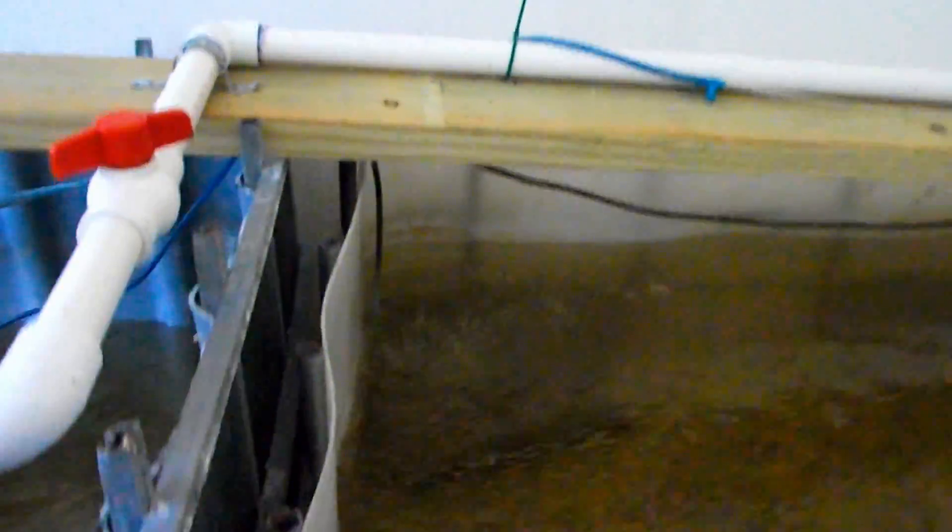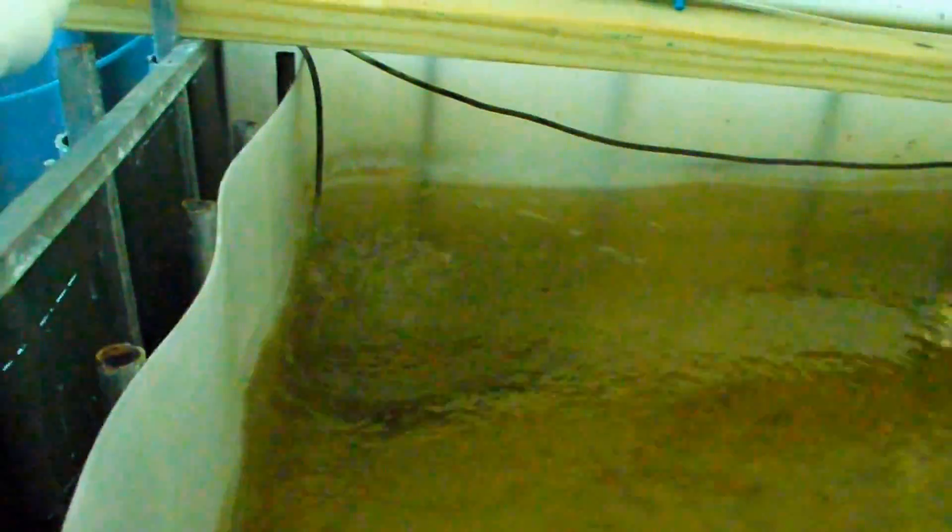You can see compared to the other tanks these all run about the same level. You can see we've got way more water in this one than in this one, and we still have a lot in the end one yet. The flush on this one is just about done — we'll close this one off, open the second one, flush that line from that point to the solids filter, and get the amount of water out of that system that we want to change.